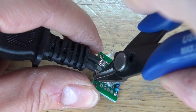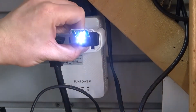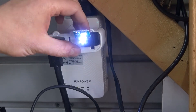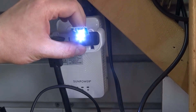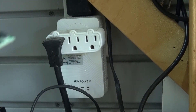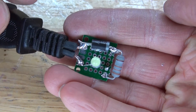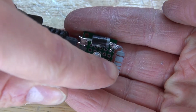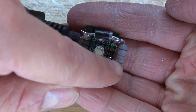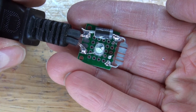The circuit is now complete — let's go ahead and test it out. Plug it in. The LED lights up, but the resistor is burning. That means there's too much power going through the resistor. Since this resistor is only half a watt, that's not a surprise. I replaced the resistor with a 2 watt 33k ohm resistor — higher wattage and higher resistance. I would prefer a little lower resistance so the LED would shine brighter, but this was the only resistor I had of this wattage.